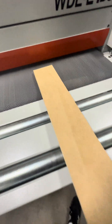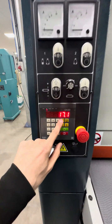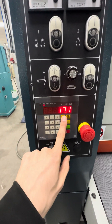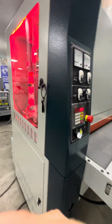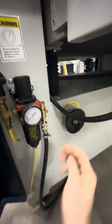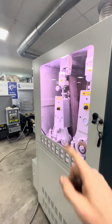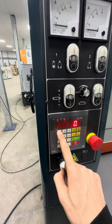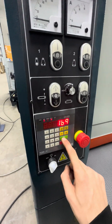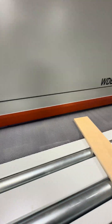Because it came out at 17.1 and it's quite accurate, I'll put some markings on this board. I will then electrically set the table — I can't do that yet because we have a red light on, and the reason for that is because we didn't have the safety ply on. Now I've got a white light inside the machine, which means we're good to set the table to 16.9. Press OK, and that will then move to the correct size — 16.9 — perfect.